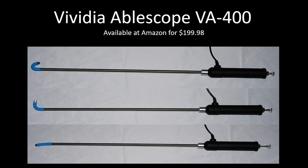The new version also has what they call a snap button and a light dimmer. The snap button is basically a shutter button that's in the cord, and the dimmer dims the lights. This is a huge improvement over the first scope. The only downside is they sealed the end of the tip with a single piece of glass, so the lights used to illuminate the subject come through the same piece of glass as the image. If you get dust particles on the lens, it can create circular ghosts in the image because the light coming through the lens illuminates the dust particles.